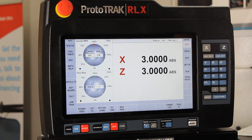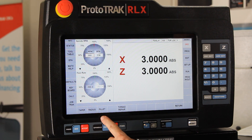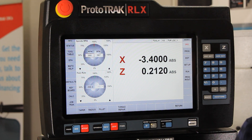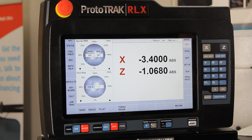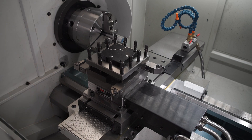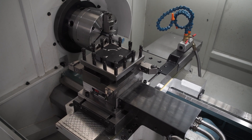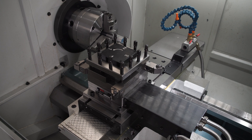The next thing is the do one function. I have the spindle not running, but in do one I have the ability to cut tapers, radii, or fillets. On a manual lathe you'd use a compound to cut angles or make special tooling for radii — here you can do it all from the manual mode. I'll move closer to the part. If I wanted to cut a 45-degree taper, I select taper, set 45 or any other number, push the absolute key, and as I turn the hand wheel the tool bit moves at a 45-degree angle. When I go backwards and it reaches the starting number, it disconnects the hand wheel so it won't gouge what I cut previously.